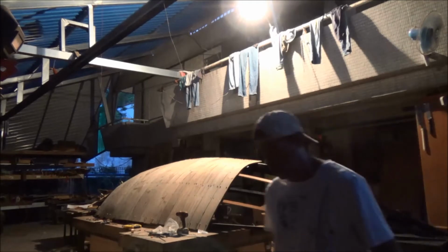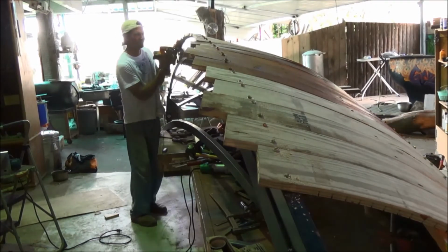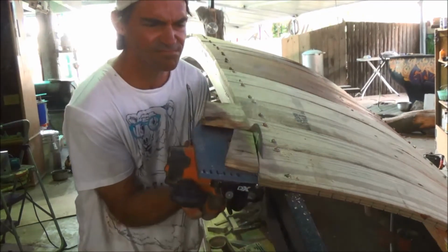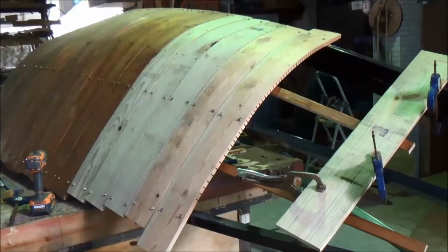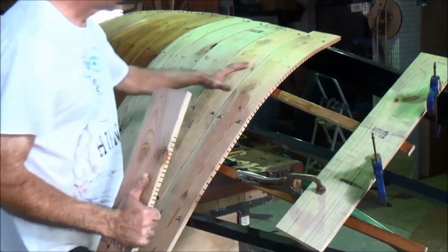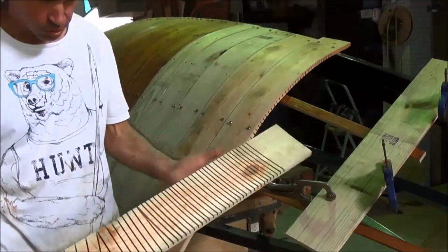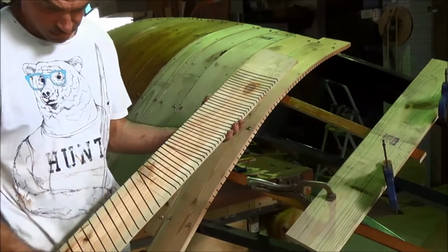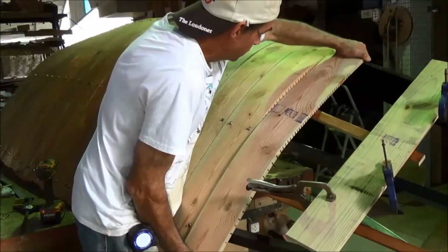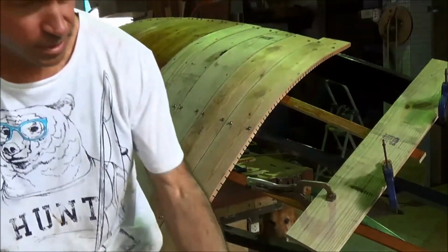Too early to make noise. Can't sleep, so we're gonna start painting. Well, came pretty close. Now I gotta figure out how to trim the front. Well, the closer we get towards the end, the more we're asking the wood to not only bend this way, but compress and stretch. So I'm changing my notching strategy. This is the top slant, fade it into straight, and then fade it back into the bottom rail slant. It's allowing for that to happen a whole lot easier. Little trick of the trade I just learned.